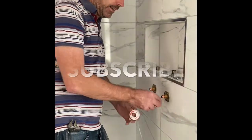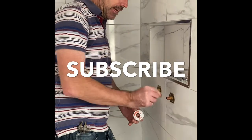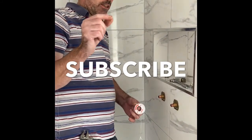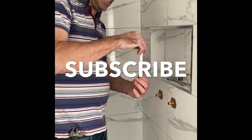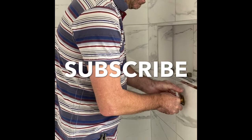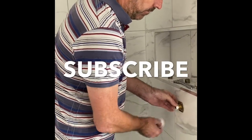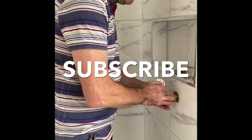So when I'm doing these, after I've sealed it all, screwed it, bracket solid, pulled my olive back - now some people say you don't need to do this. But there's always a possibility that this olive could leak. So the way to stop that possibility: slide it on there, always tape it the way that you're going to be screwing it on. A couple of times around it. Then slide it back in. I've taped the olive down.